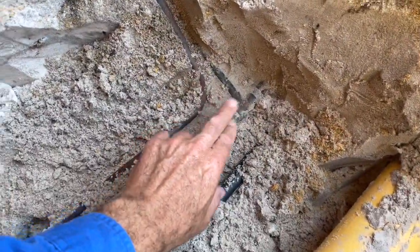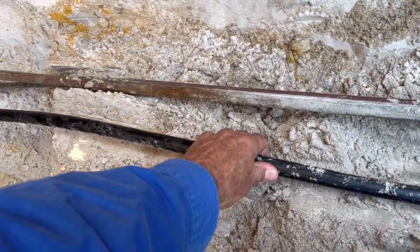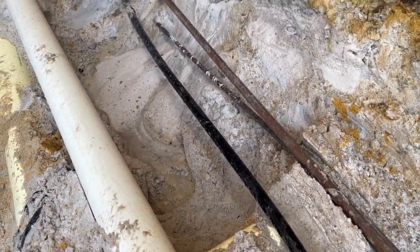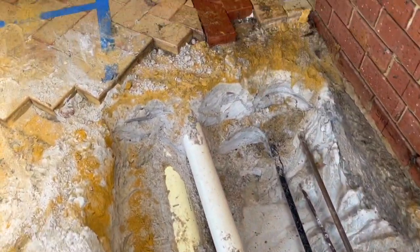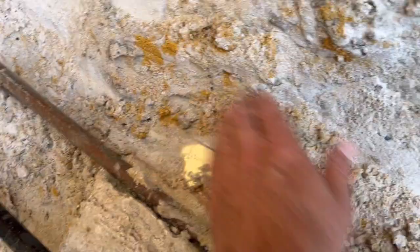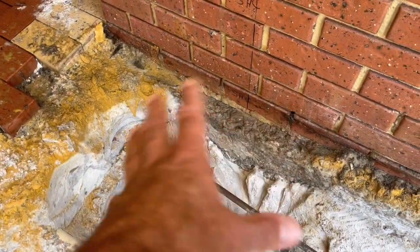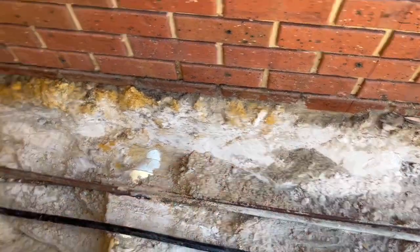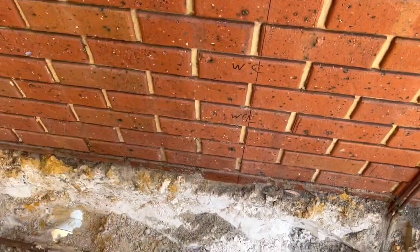So that means we can more or less delete that hot main completely. The cold main here goes into a tee for the cold main, which makes sense. Down here there's also a copper pipe for the gas main. I'm not sure what this other one is - if this is a live water main, because it feels like it's a blue line poly. I know I have a larger one going from my water meter, so I'm not sure why they've got this cold main here as well. We found the sewer goes up here - it's 100mm. You can see there's a bit of a step down where it drops to 65mm. We just need to cut that off and reconnect. We've got to prep now for the core drill through here for the shower, and core drill through here for the toilet.